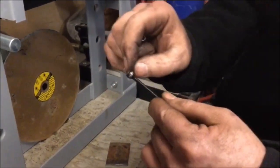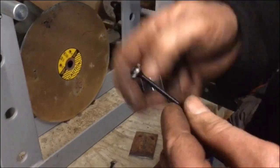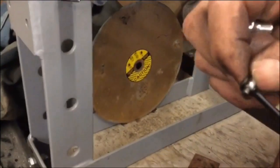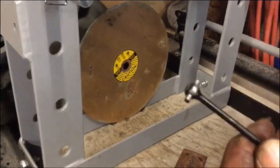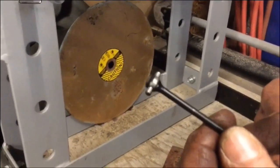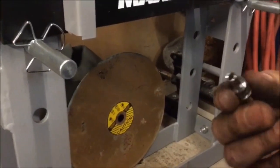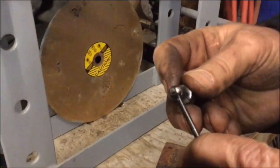Here are the dog bones, and we've discovered that they've flattened and mushroomed on the ends. So instead of replacing the dog bone itself, we found that we could buy a whole pack of the cross pins for like six bucks. So we're going to press them out in our press, in our homemade jig, consisting of a 5/32 socket to act as a receiver.